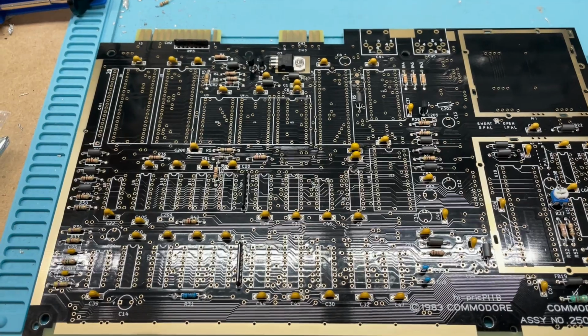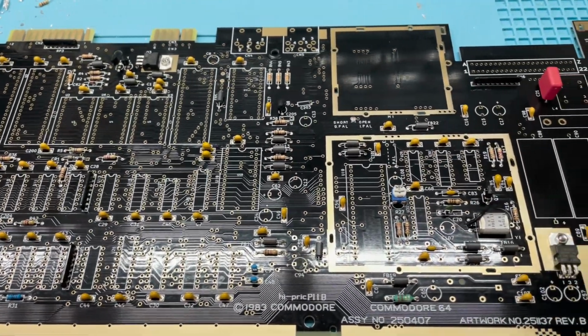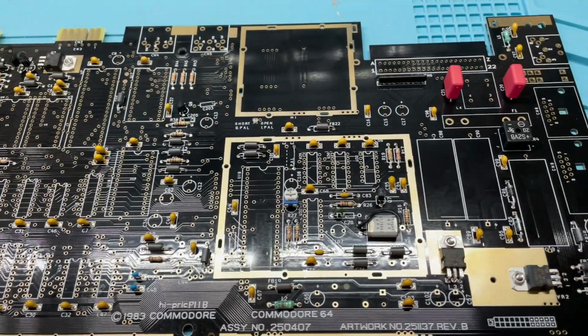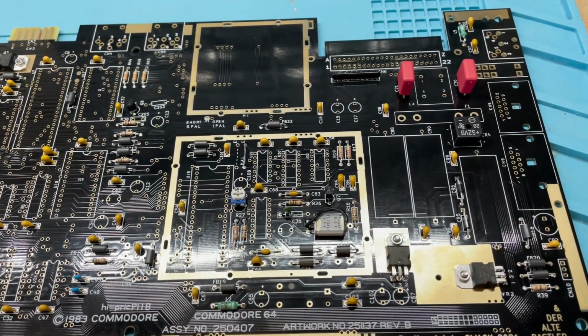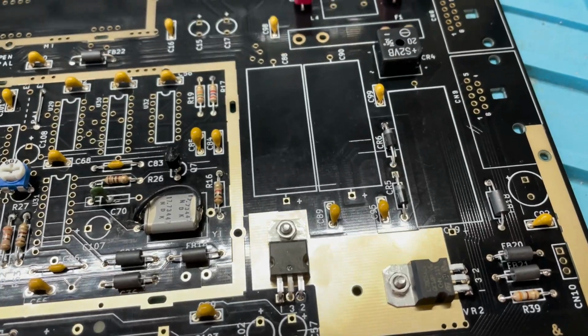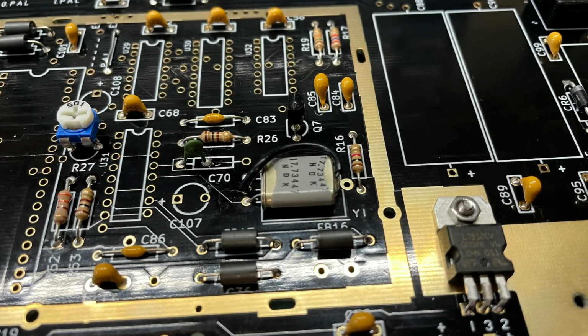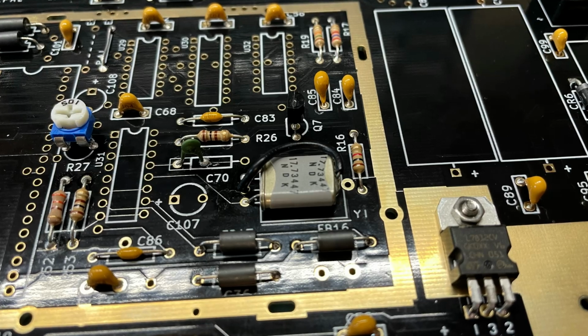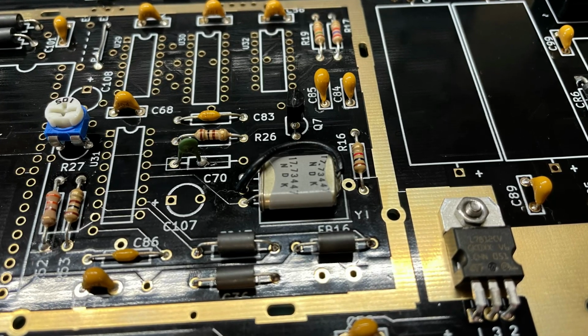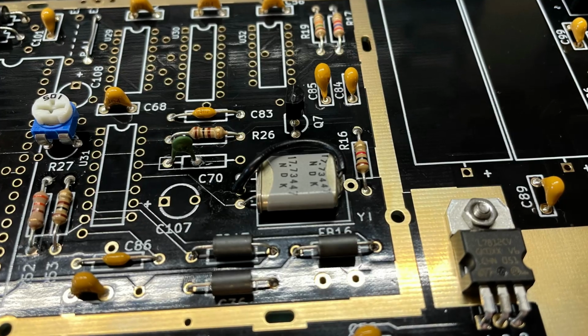Feeling refreshed after that, and it didn't take long to pop in the rest of the components that comprise the power circuit. And we've just got the choke to pop in later. It's a tall part, so we'll do that when we do the larger capacitors and connectors. We've repurposed a salvaged crystal, as the one in the pack was a later style package, and well, this one just looks nicer and more in keeping with the board, I think.